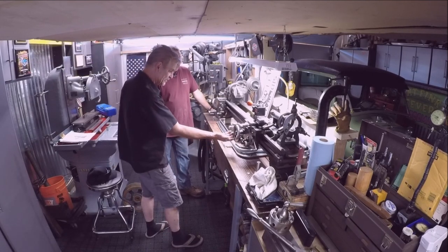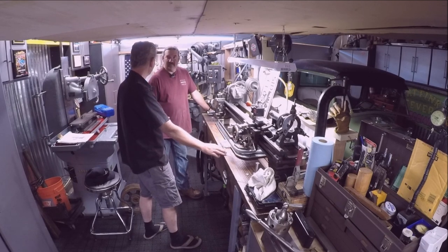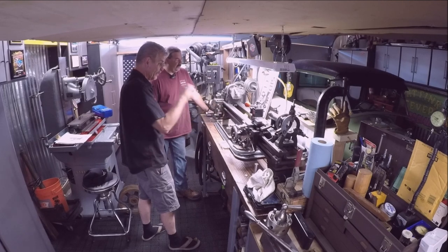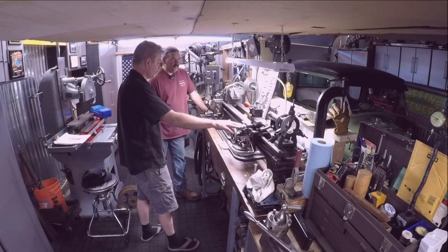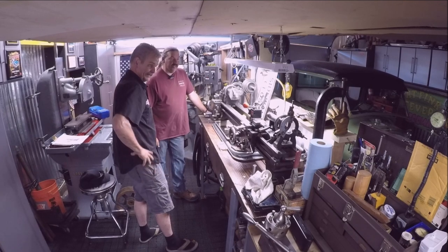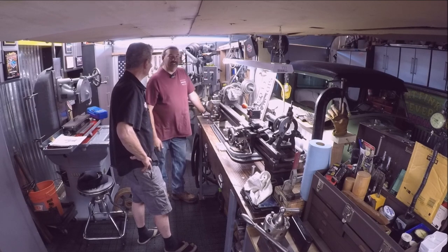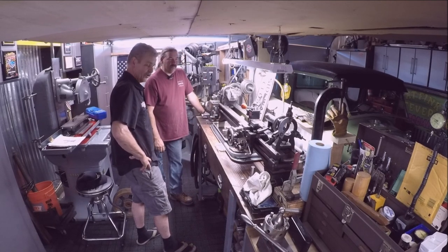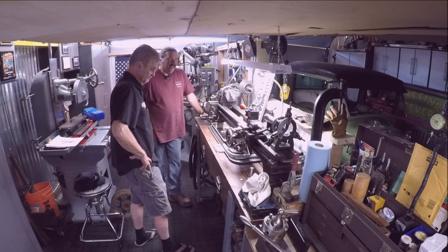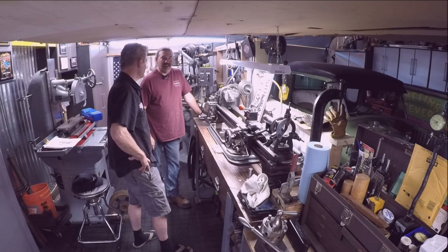You could see that underneath the dials they were still pretty clean, but on top of everything was just a fine coating of rust. I didn't run the saddle back and forth because it had quite a bit of garbage on it. For you guys out there, that's a good idea — if you come up with a piece of machinery that's really rusty, don't go grinding everything up by dragging it back and forth. If it'll move a little bit, that's good, but don't run it up and down the bed because you're just tearing up stuff.